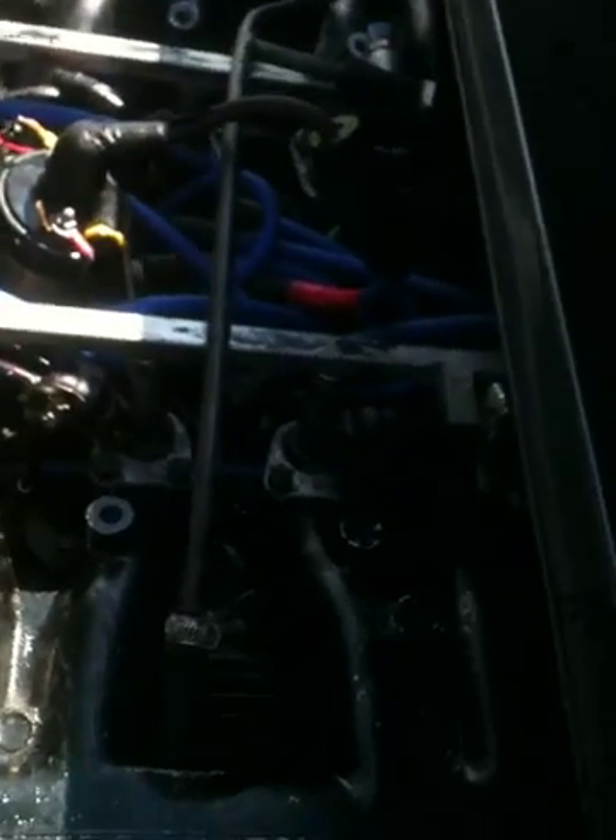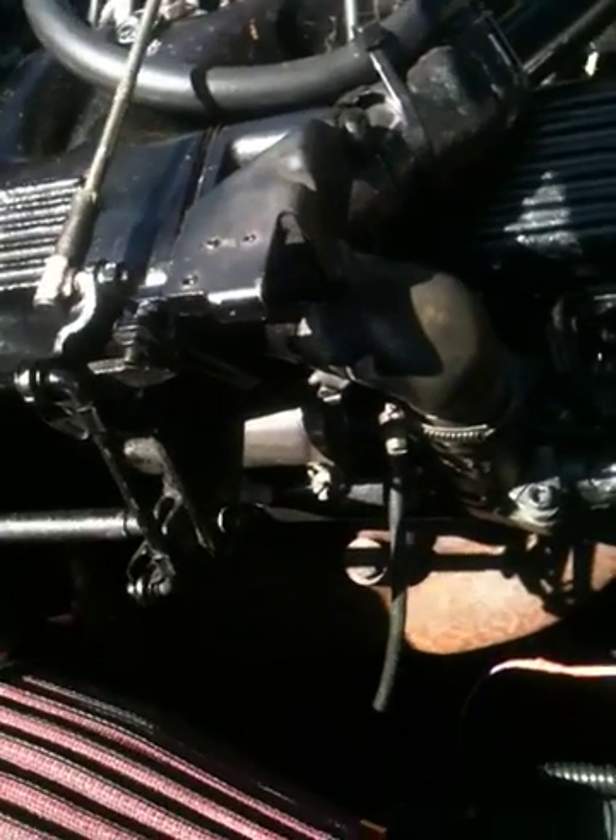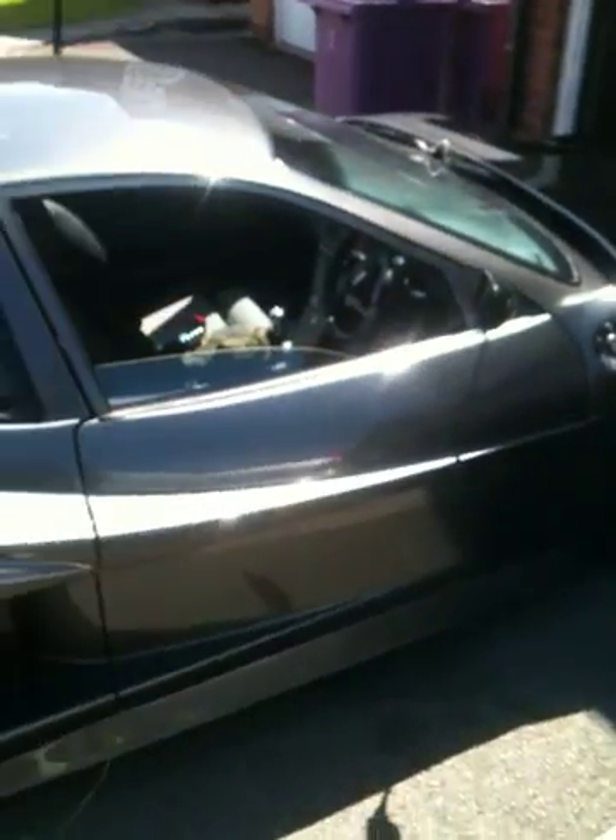So now what I've got to do to get full power is adjust the mixture. That's pretty much how you work out the timing on a V12. The engine's running, the timing's done. I've just got to adjust the mixture a little bit, which means adjusting the butterflies here — just play with the butterflies and play with the mixture to get my full power back. Because at the moment, like I say, it's only running on about 70% power. But we'll get there. So for all you people who wanted an update, that's where we're up to.